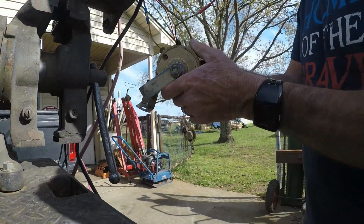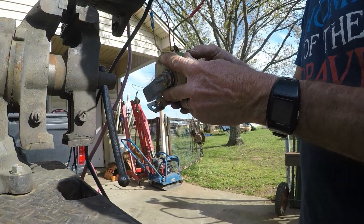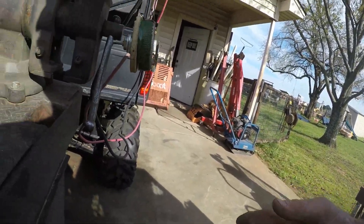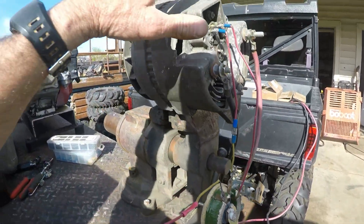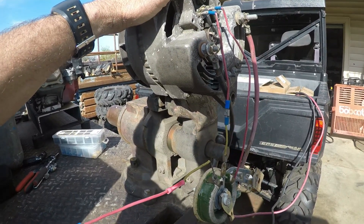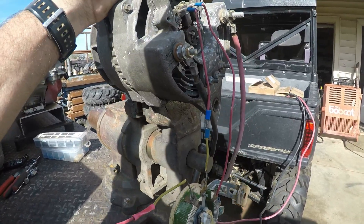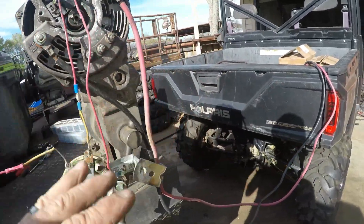This is not the correct potentiometer — it has some adjustment for welding but not a lot. That's why I think if you ordered one for a little Lincoln welding power you could probably adjust your amperage a lot more. I was told this was a 270-amp alternator but I believe it's only 200 amp. You can get them in 90, 100, 180, 200, and I think they do have a 260 or 270 amp. That takes care of everything needed to make it weld.